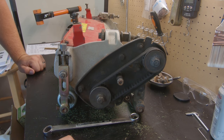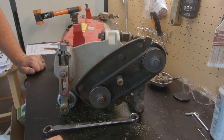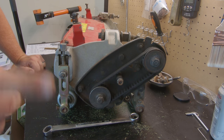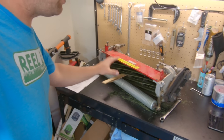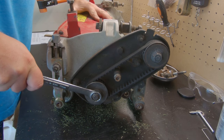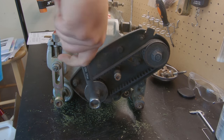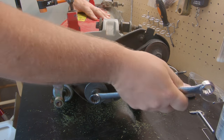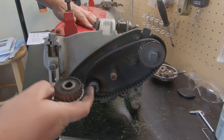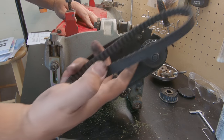Leaving the front roller on for now — the service manual doesn't call for its removal yet. We need to start by removing this 18 millimeter locking nut, which holds the left-hand side of the reel. There's a woodruff key inside this pulley that you need to make sure you don't lose. We use wood blocks to prevent the reel from turning. This is your normal right-hand thread; the other side is left-hand thread. Locking nut is off — slide the pulley out and there's the woodruff key. Don't lose that. Toss the belt.